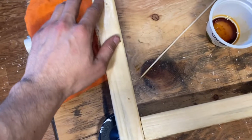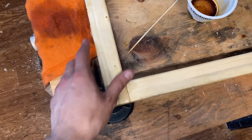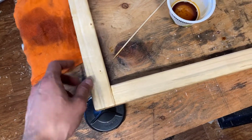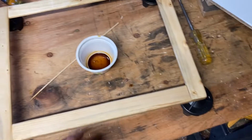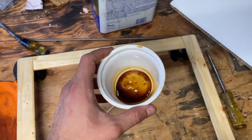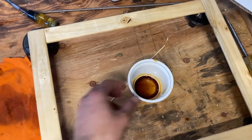Just a thin coat. It was almost dry within a few minutes. It was enough that I could hold the frame and manipulate it around. Did both sides. I'm not going to touch it now while it's curing, but you can see there are some chunks in it. I didn't mix up very much, but there are a few chunks in here. I think that's because of this can of poly. It was about 2 years old.